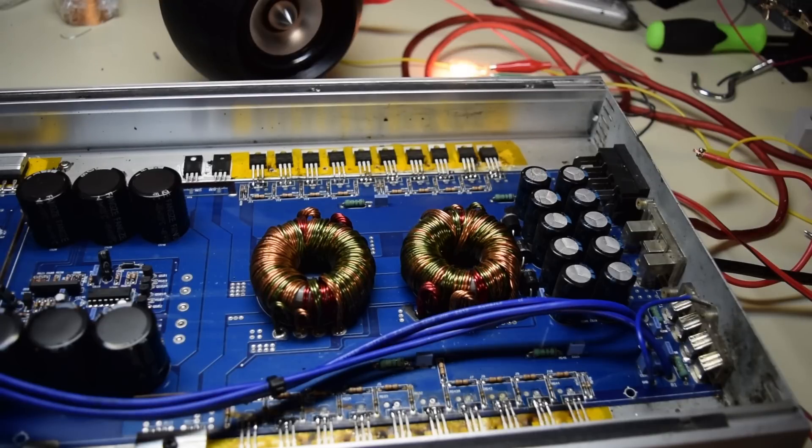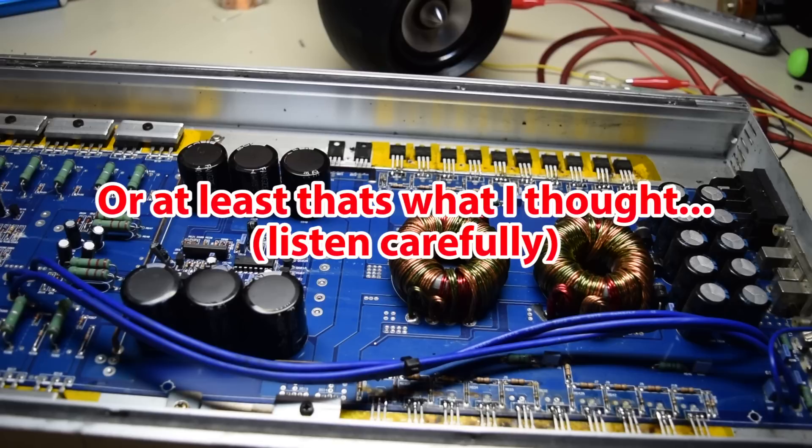And there you have it folks - back to normal. Turns out it's not quite fixed just yet. With the current limiting bulb in series into the power input it does play, however there is still a short somewhere on this board. Eventually I'll figure out what's wrong with it. I thought this was a great board to start out with for an amp repair - it's all through-hole components, which are kind of hard to come by. Most amps nowadays are surface mount, which is really hard to work with. The bottom line: this amp seems pretty fixable.